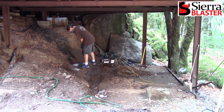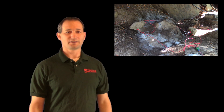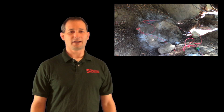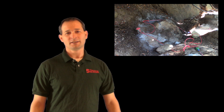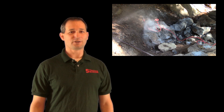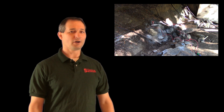In this next video, we're blasting a rock that's about ten feet away from the resident's foundation, and it's under a wooden deck. The owner wants to put in a storage box under the deck, and this rock stands in the way. So we did multiple blasts using multiple heads with boosters, and we had absolutely no problems whatsoever. It's safe to use next to or under structures.